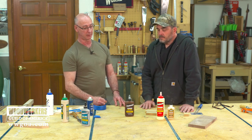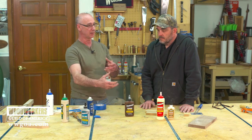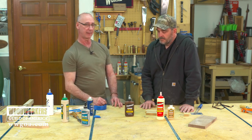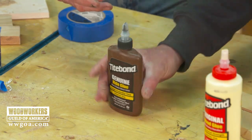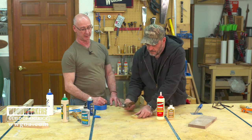So it's pretty commonly used in instruments, by luthiers, and part of that is tweaking an instrument for another player or doing repairs in the future. And also veneer applications, where you veneer a table today and 50 years from now the table is sound but the veneer has to be replaced because it's been beat up. So hide glue is also commonly used for that.